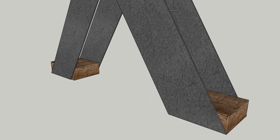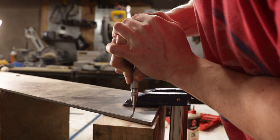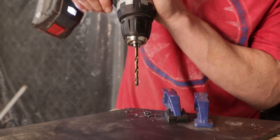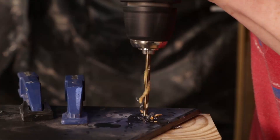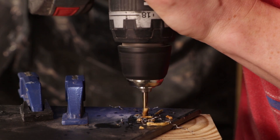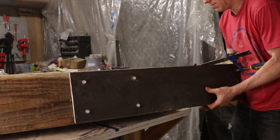After gluing up three pieces of four-by-four lumber to make each foot, I used quarter-inch lag screws to attach each foot to the steel legs. I can already hear it in the comments — yes, I'm screwing into the end grain, but I decided to take that risk and it worked out okay. If you do this yourself, you know it is a risk, but you can always try and see — it worked out okay for us.